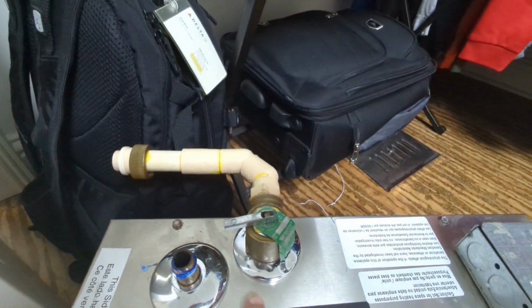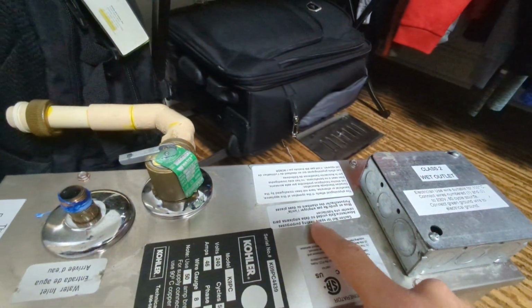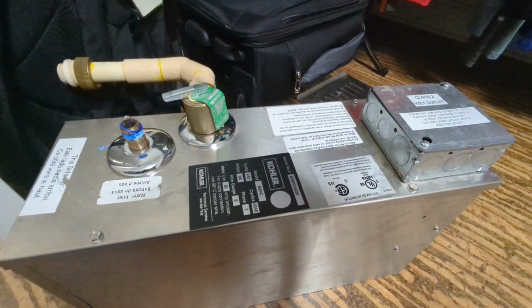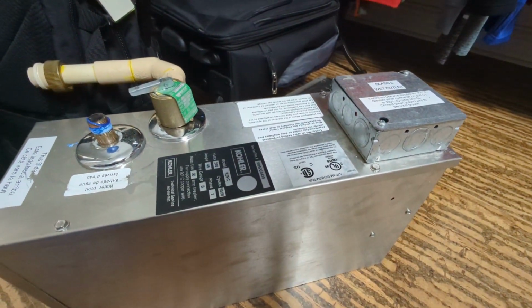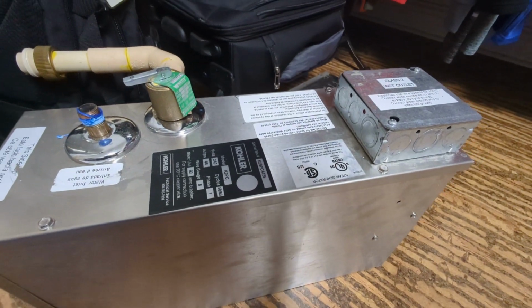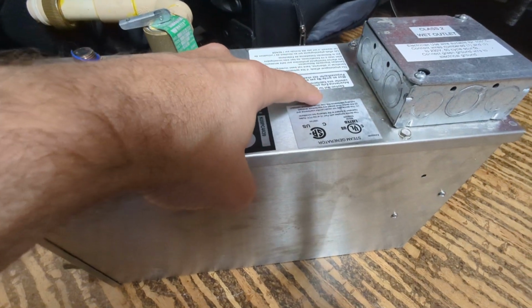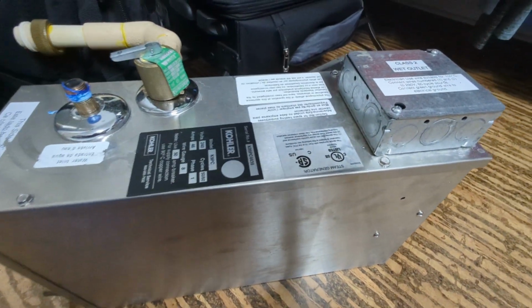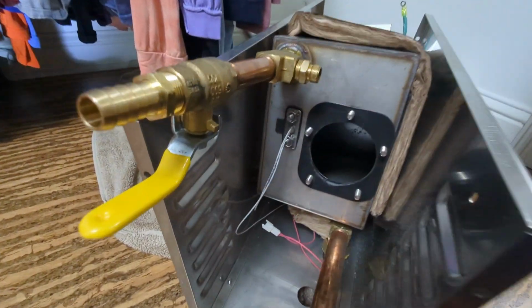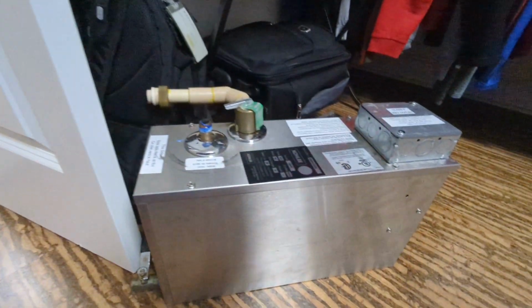Normally, there's a light right about here on the junction box on the 5529. Slightly different junction box, but right about here. If that light is on, that's telling you that the thermal fuse is intact. There's actually a fuse in line with that. So if that fuse isn't working, that green light will not be on. So if the green light is not on and you're getting an error 5, then you can probably suspect that it's going to be this $37 part, which is your temperature fuse available from Kohler. And again, you cannot get that from Thermosol.